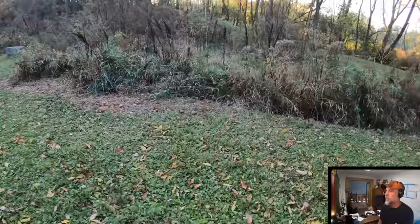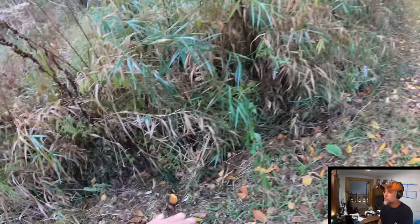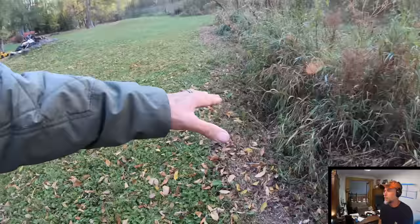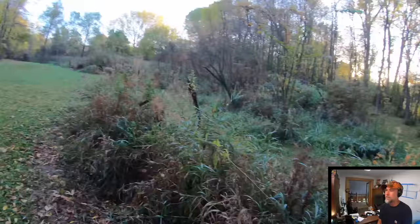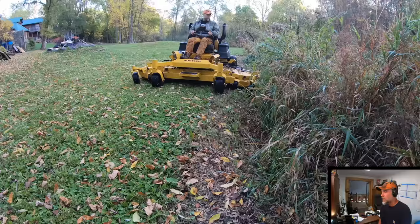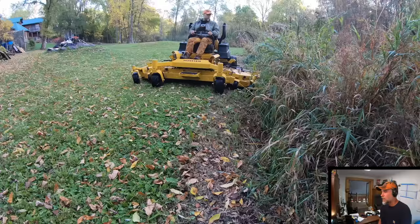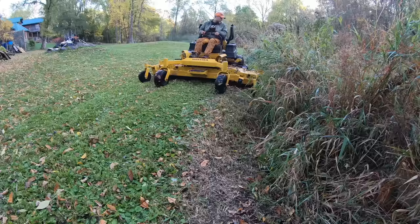I want to show you something — I've never been able to mow this ditch. It's always been hand-trimmed. So I was able to lay this mower right in here. I'm going to come in and demonstrate on this side and then attempt to cut that side using the same technique. Once you go over 15 degrees it does shut the entire deck off — all of your blades. It has a safety lever in there: if you go too steep, it just kills it.